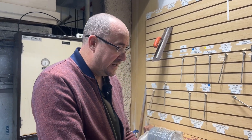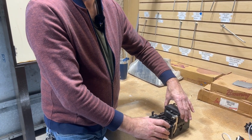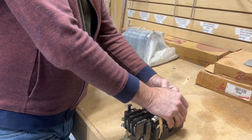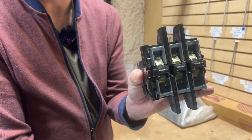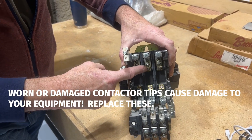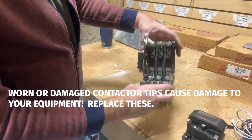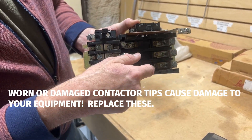What a lot of people don't understand is that these systems, if not maintained properly, will blow up your motors — they'll overheat them and arc them out inside, causing a lot of problems. They make them really nice and easy so you can maintain them. This pulls out, and these little tabs inside are basically what bridge the gap. As this engages with a magnetic coil — similar to a doorbell — these little tabs get scored up. You can see these tabs are well worn and they need to be replaced.